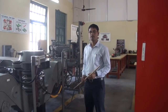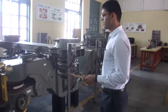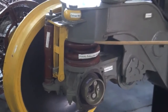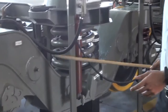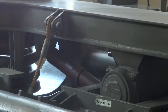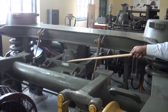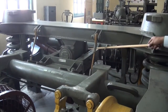One of the many features of a Fiat bogie which allows travel at high speed is that it has four vertical dampers at the primary suspension level, two vertical dampers at the secondary suspension level, and lateral dampers one on each side of the bogie. An added feature of the Fiat bogie are two bump stops: the longitudinal bump stop and the lateral bump stop.